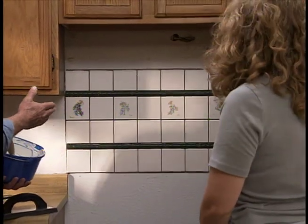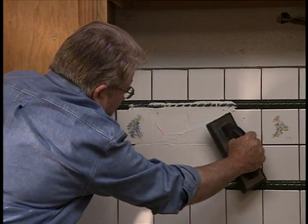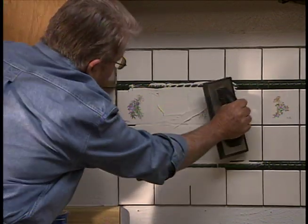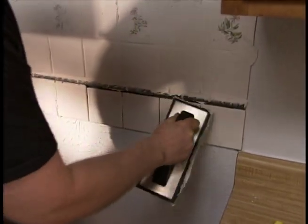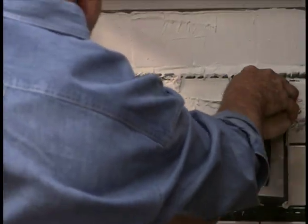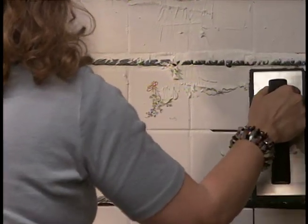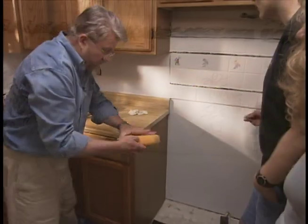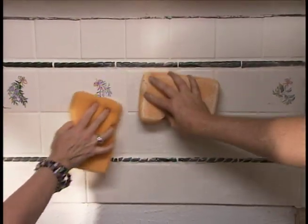The tile looks great. Now for the final tiling step: grouting the joints. After the mortar has set up, we mix the grout and I use a foam rubber float to force it into the gaps. Holding the float at about a 45-degree angle, I rake it diagonally to squeegee off the excess. When you see it bulge out like that, it means the grout has gone all the way to the bottom of the joint. It can be a little messy, but once it's begun to dry on the face, we use damp sponges to clean the haze off the tiles — washing it off the surface while leaving it in the joints.